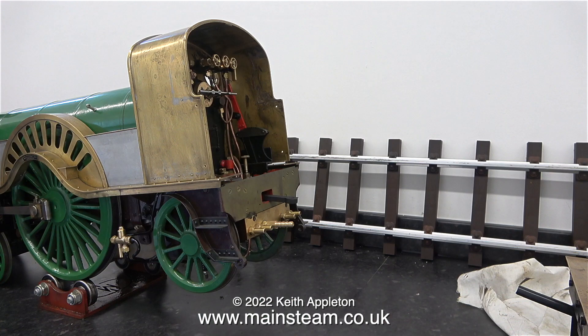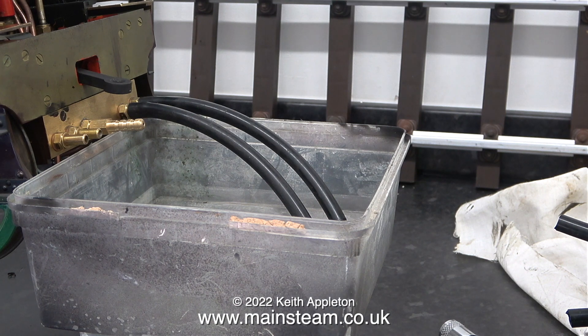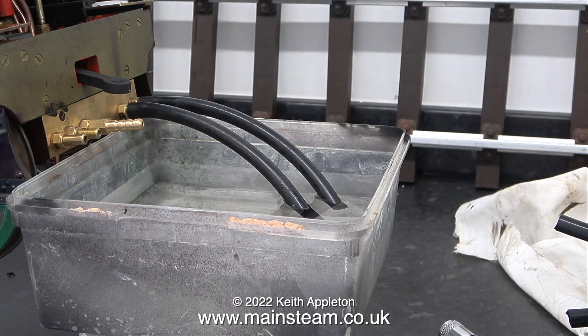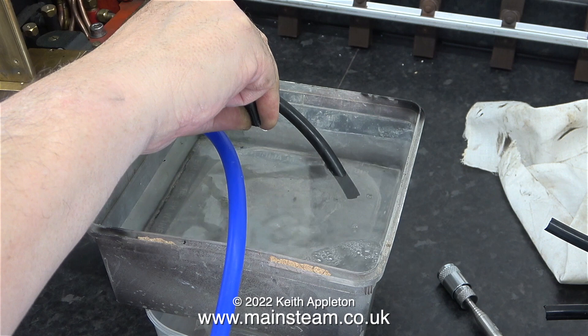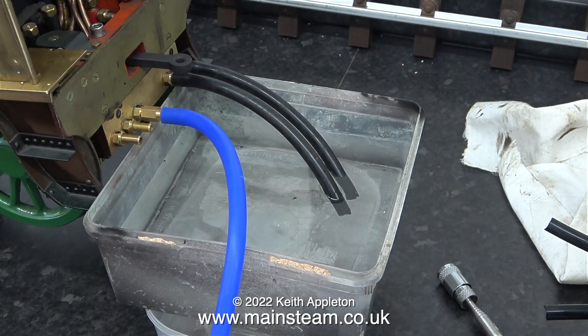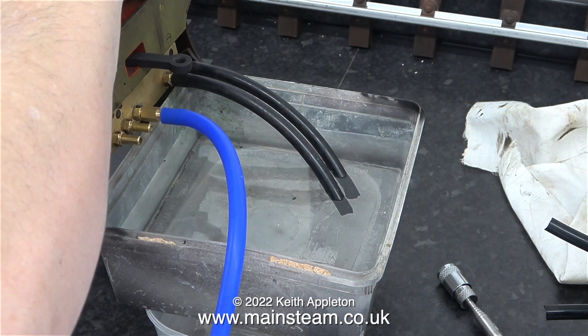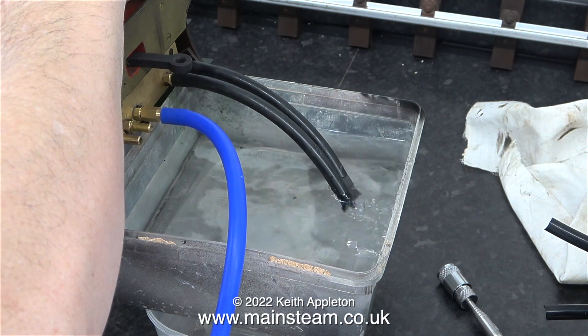What I'm about to do is verify where the piping is exactly. I'm going to connect two pieces of silicone rubber piping to the inlet of the axle pump and the bypass from the axle pump, then fill a container with water. With the black silicone rubber pipes in position, it's time to connect some compressed air through the pressure feed — which normally goes to a check valve on the back head of the boiler. When I open the compressed air valve, the engine starts to run quite slowly and, as you can see, it's pumping water beautifully. I then close the bypass valve and with a click the boiler check valve, or clack valve, opens suddenly — that's why it's making a noise.